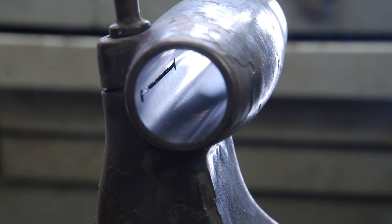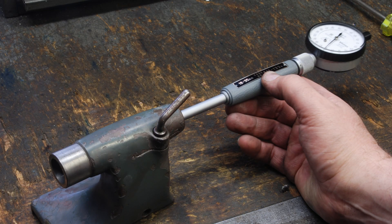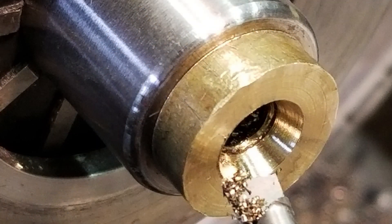All that's left to do is to very carefully measure the bore, and then we have to make the tailstock quill to fit, which presents some challenges. Our goal is to have about two tenths clearance between the quill and the bore, and since we've just made the bore bigger by lapping, we've got to do something to enlarge the size of the quill — and that something is hard chroming.